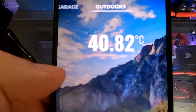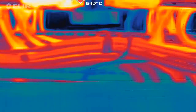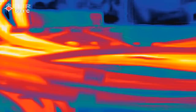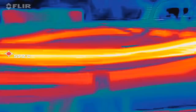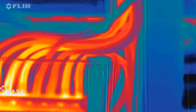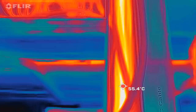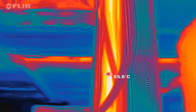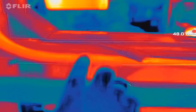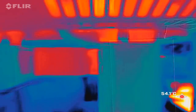Garage is 34 degrees, outdoor 40. Welcome to sunny hot Australia. Let's have a look at the cabling situation in the duct — this is the big slotted duct full of cables. We can see warm cables here at 50 degrees. The solar coming from the west roof has a bit of a hot spot at 55-60 degrees cable temperature. These are cables going up into the ceiling, 55 degrees as well — all 16mm solar cable carrying around 50 amps at the moment.